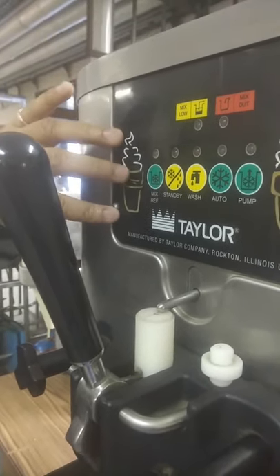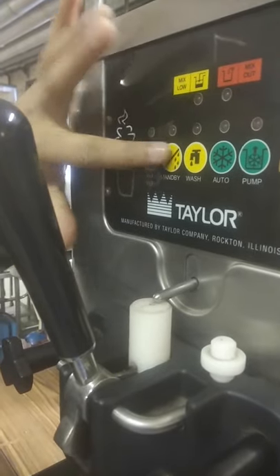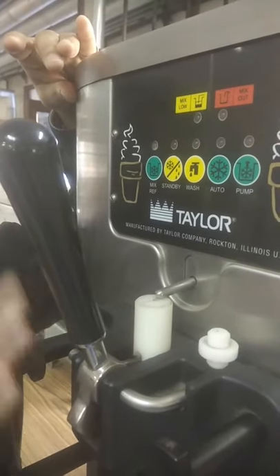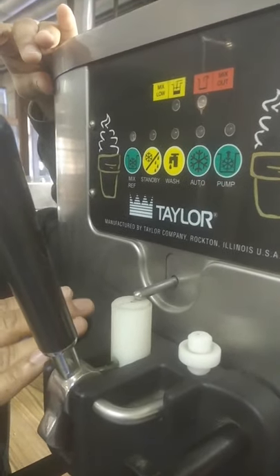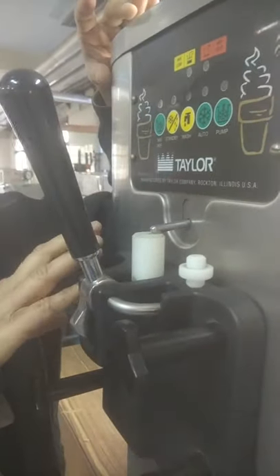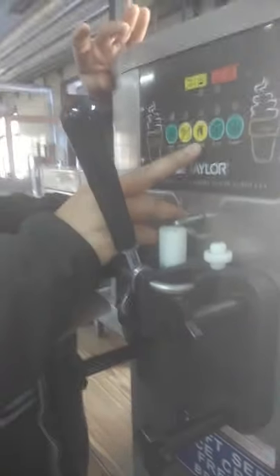This will be having its own refrigeration unit, which will be switched on when we use this button. It will pull the mix to the refrigeration temperature. Standby mode will be maintaining just that temperature and cooling will be in start-stop cycles — that means as and when the temperature increases by one or two degrees it will switch on the compressor, and when it reaches the refrigeration condition it will switch off. So the machine will be just ready to go.